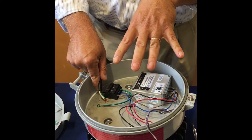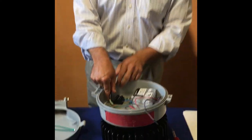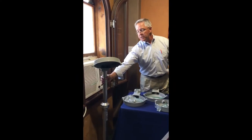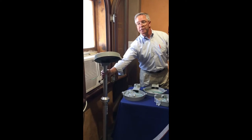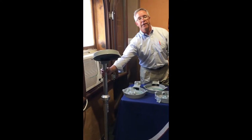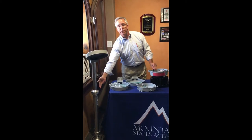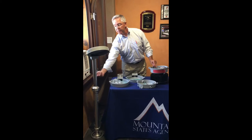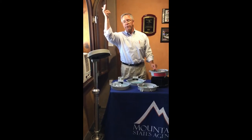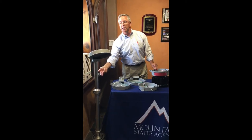This can also be mounted on our V-spring. The V-spring is made for industrial applications on block walls. It telescopes up to a mounting height of 8 feet 5 inches. The safety feature is it has a 12-3 SO cord coiled up inside — you just raise it up with no disconnection. When it comes down for maintenance, you simply lower it back down.